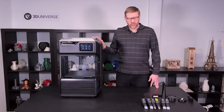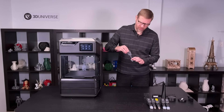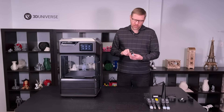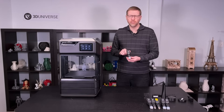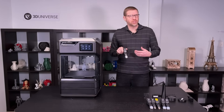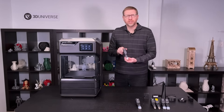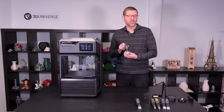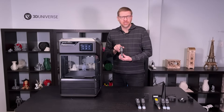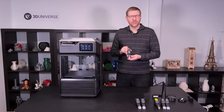There are a number of different extruder types depending on the type of material you're looking to work with. All of these extruders share a common design — they have a very long design because they extended the heated core so that you can melt materials a lot more efficiently, and extrusion is a lot smoother as a result, even with more advanced high temperature materials. You have the Model 1 extruder for lower temperature standard materials like PLA, tough PLA, PETG, or nylon. You have the Support 2 extruder for water-soluble PVA support material. Then you have the Model 1C extruder for composite materials like MakerBot nylon carbon fiber and other abrasive materials.